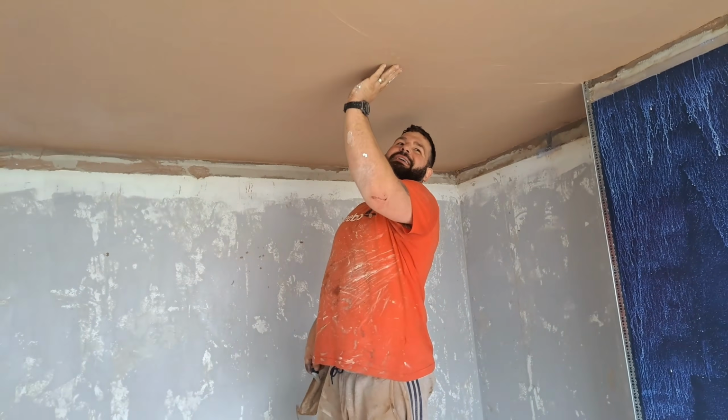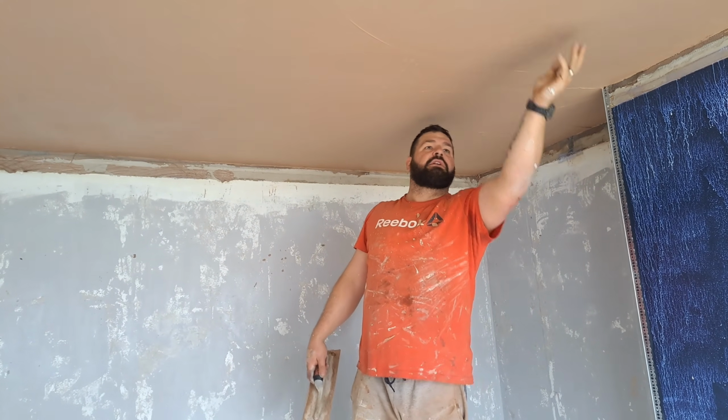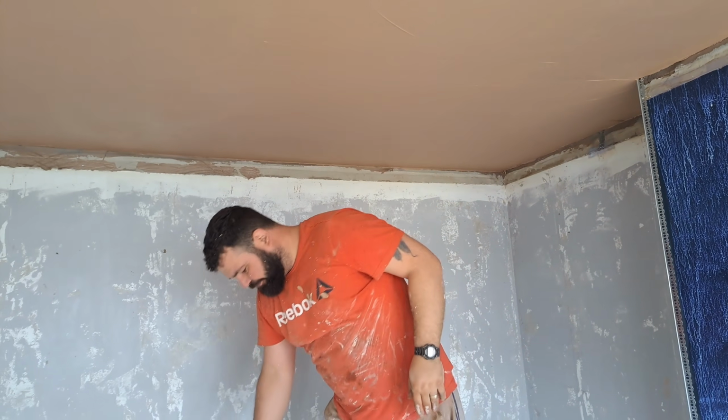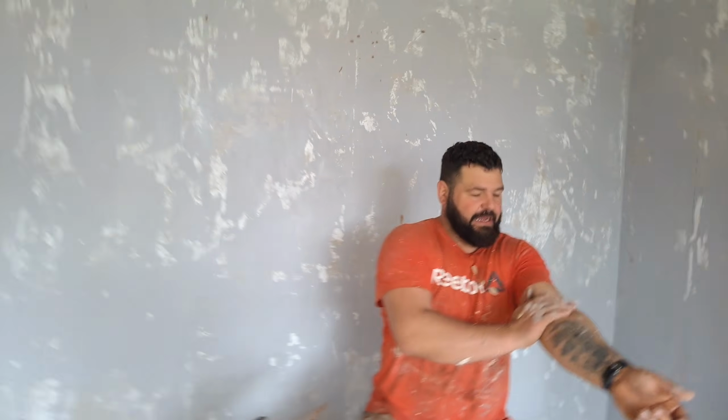It's a little bit too far gone on, so there's a bit too much suction still. So at this point, what I've seen in the past is a lot of plasterers start panicking, going like flipping lunatics, as fast as they can, splashing it with water and everything. I'll show you a little trick that we do, and it involves just leaving it for a little bit.